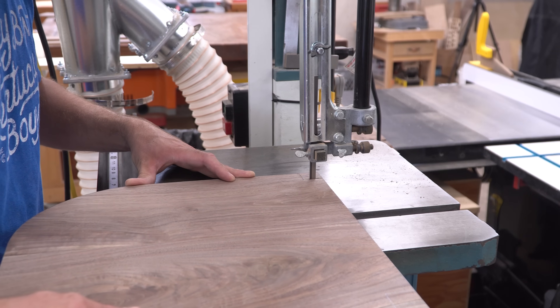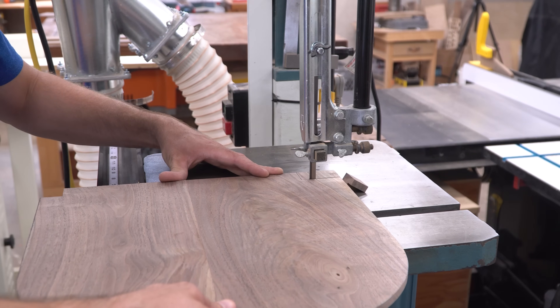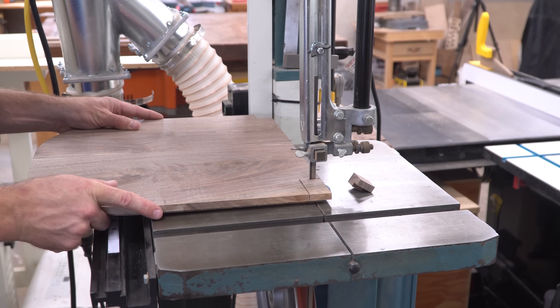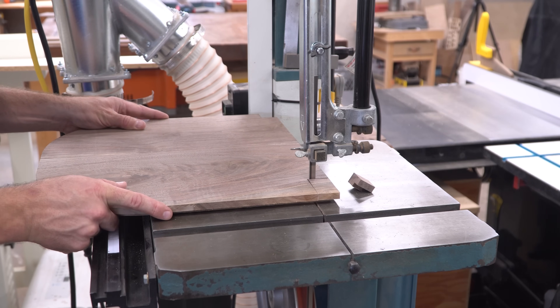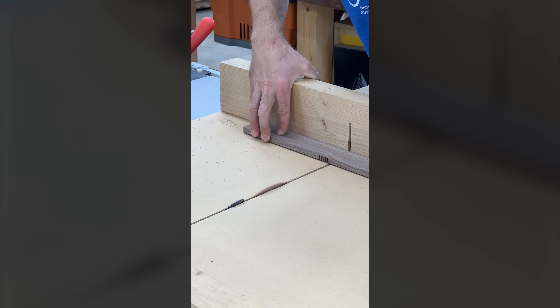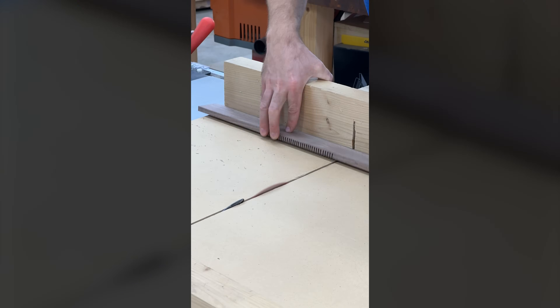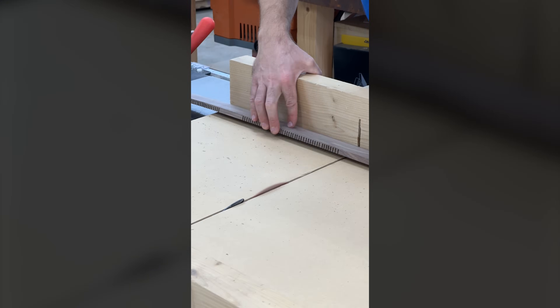Based on the notches in the steel door, I also notched out the top corners in my panel. These notches are all about clearance while opening and closing the door, and a little later on I will point out where I foolishly thought I knew better than the manufacturer. Here is a time lapse of me kerf cutting the sides of the door. The process allows the wood to bend so I can match the curve of the panel without having to mess with bent laminations or steam bending. Unfortunately, I set up my phone for this shot to get some killer footage for the social medias, but this led me to forgetting to set up my good camera. Dummy.